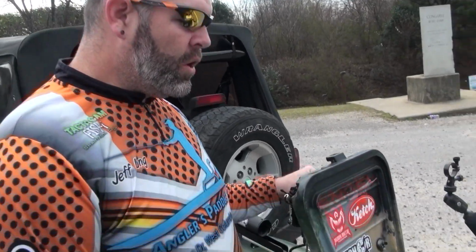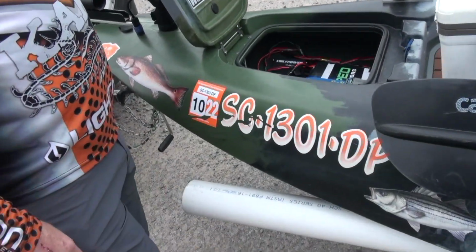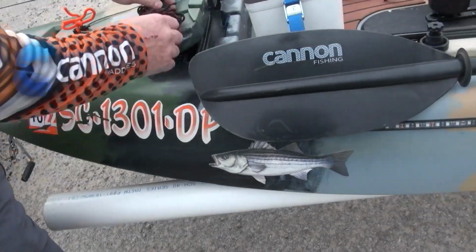I don't have side scan. I just have a standard scan with down imaging. Right. And I've actually glued my transducer inside the hull. And had very good readings, no issues out of it. Works well, and it's out of the way. I don't have to worry about hitting anything, catching anything, ripping it loose.